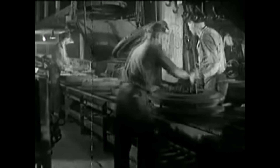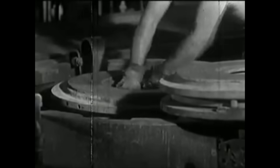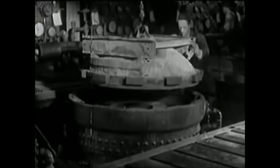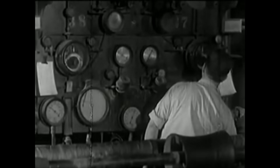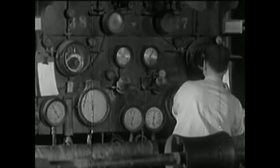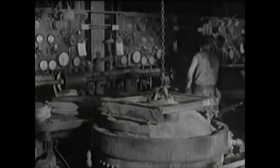After the tire is placed into the mold and the top half of the mold clamps down, it's lowered into a huge boiler, or vulcanizer, and a fitting is attached to the water bag inside the tire. Twenty-eight molds are placed in each vulcanizer, each mold fitted with a water connection. A hydraulic ram gradually lowers the molds as they're placed; the water fittings interlock, forming a pipeline. When the vulcanizer is closed, water at a temperature of 300 degrees Fahrenheit and at a pressure of 240 pounds to the square inch is forced into the water bags inside the tires. At the same time, steam at 300 degrees Fahrenheit is applied to the outside of the molds. The temperature, pressure, hydraulic ram pressure, and curing time are all accurately controlled from a central point by automatic regulation. The slow baking process gives an even cure throughout the tire and induces full adhesion of carcass and tread — not obtained where air is used in the bag and curing is done from the outside of the molds alone.